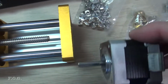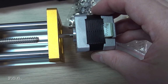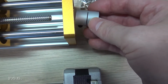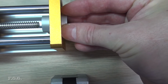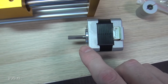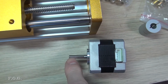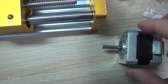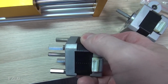So that means with that longer shaft, because of the stronger motor, we really need to have quite a lot of standoff so that the coupler, and the coupler is a little bit different, but we want the coupler to finish probably around about there, right? Something like that anyway. So the first problem is I don't want to use plastic spaces because this is an all metal configuration, and the second issue is that the spacer needs to be longer because the shaft is longer.